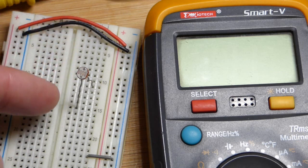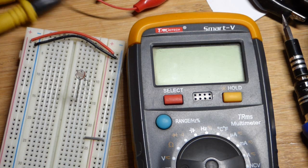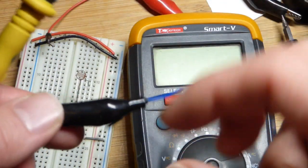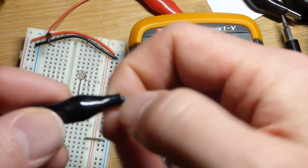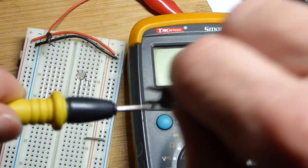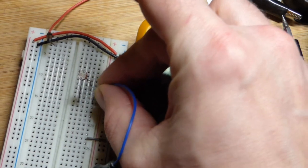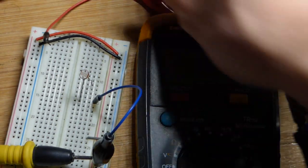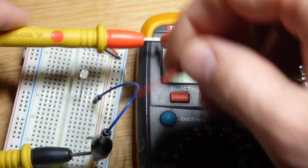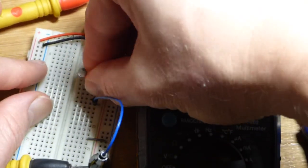So we're gonna come back, and I won't be able to hold the probe steadily enough, so I have these alligator clips. I crimped just with pliers the clips to the jumper there. We're gonna clip that on there, and now the black probe is attached to that lower side of that light-dependent resistor. Doesn't matter which side you measure — the resistance is the same either way. Red probe, same thing right there.